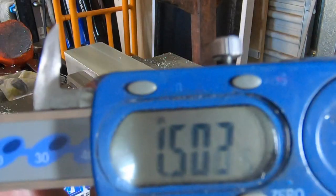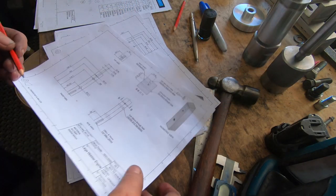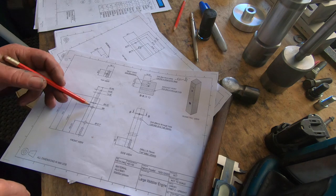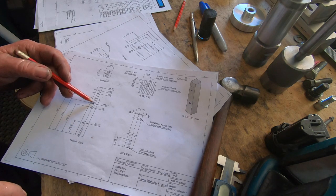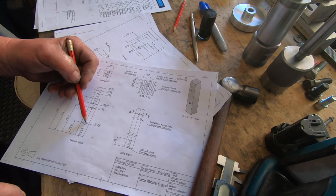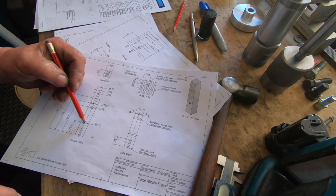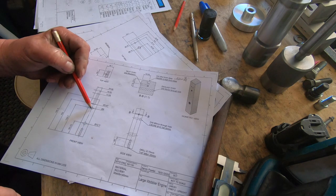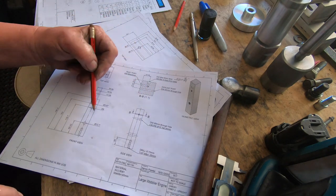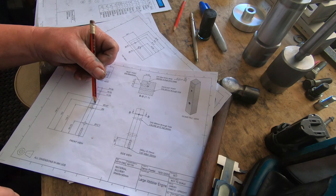Engine half. So I've gone ahead and set out all these dimensions here on that block of aluminium. Simply scribe the line, centre punch the marks. I've got it set up in the drill in the small mill. I'm going to put all these features in, so it's a half inch hole there, 12.7. An 8mm hole there. It's also got a half inch counterbore, and a couple of 4mm holes up the top here.